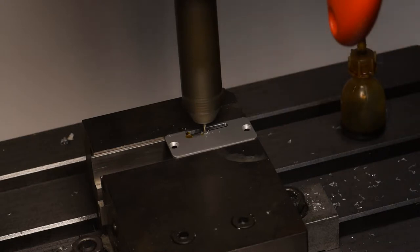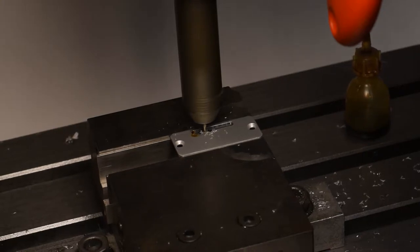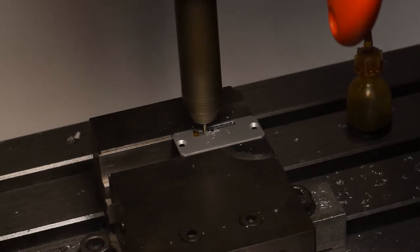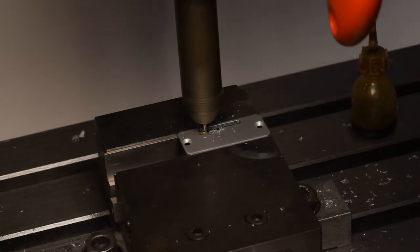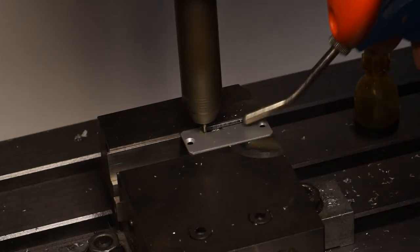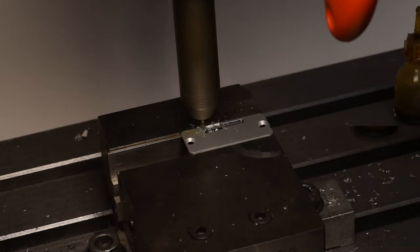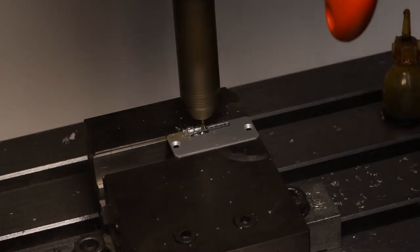And since we can't de-recess it, we're just going to make a hole in this front plate, which is broad enough, like the usual plastic coating around USB connectors, and which allows us to get close enough to the pyboard with the connector. You can see we do this on both sides, so this is basically like a bevel inside the front plate, which is where the USB connector plastic fits in.